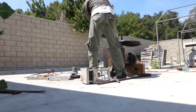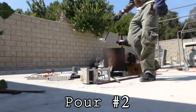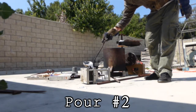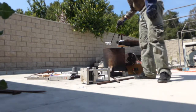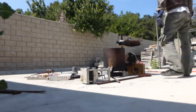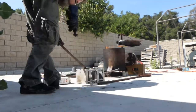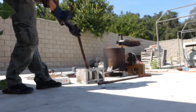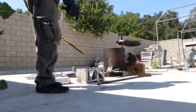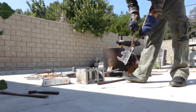Pouring attempt number two did exactly what I was afraid would happen — it stuck to the non-ejecting half of the mold. I thought I was about to give up, but I said no. I opened up the mold and I was able to hammer it off. Amazingly. Then I got the mold back closed again. I think I spilled some metal on this one too — between where the mold opens and closes — so I had to pry that out. And we got another incomplete soap dish.